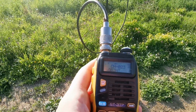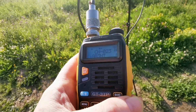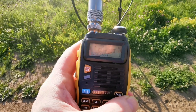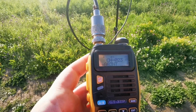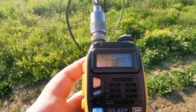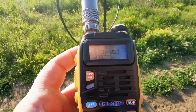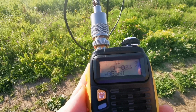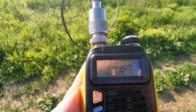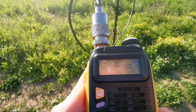I did test the SWR. I'll put it on the analyzer and show you at the end. It is about 1.2 at the bottom of the band and about 1.5 on the top of the band. We're going to try and give a couple of shouts on the call-in channel, but I've just tried it and it's opened one of the local repeaters straight away. I'll try this one as well — I think it might be up Newcastle way, about 25 miles.